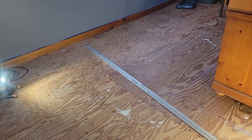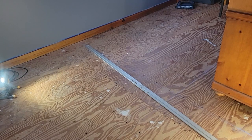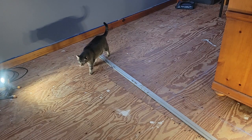All right, I'm sharpening my pencil. I got my chalk lines crisscross center to center. I brought in my Swanson 8-foot straight edge. The chalk line you walk on, it disappears. So I want to put a permanent line with a pencil. And then I think I'm going to use a pressure sensitive adhesive. And you put it on thin, I might roll it on.